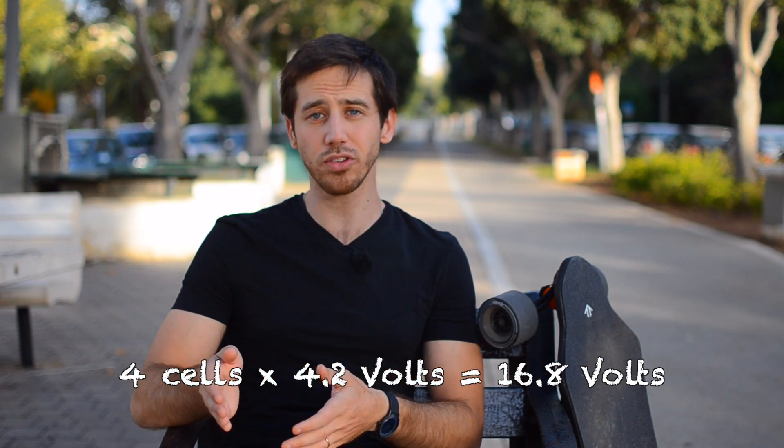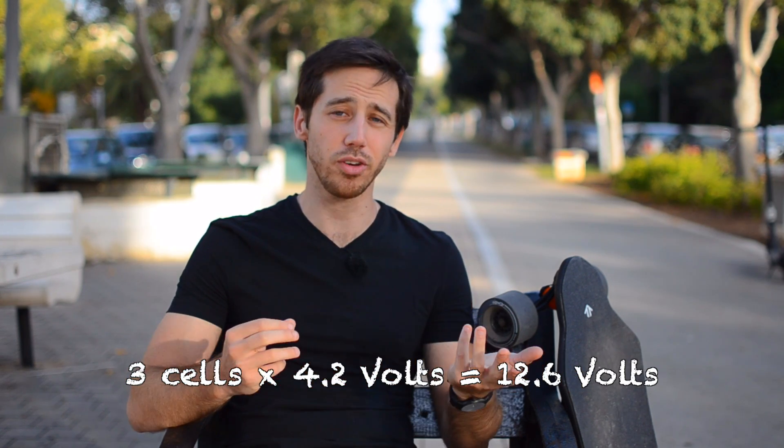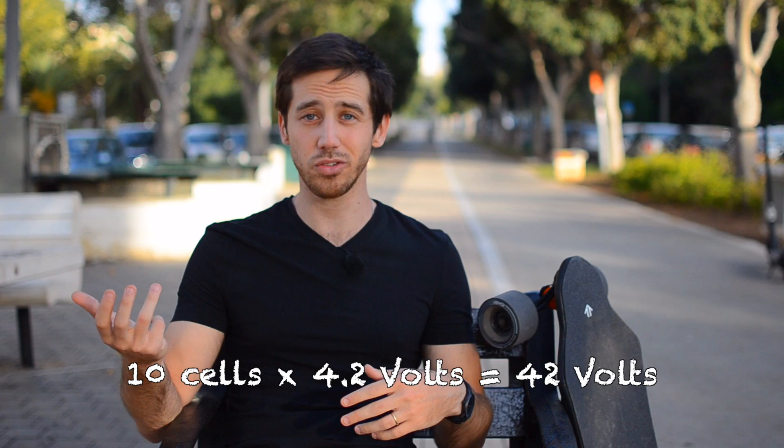The last question I saw a lot was how to find the right charger. I already had a charger for that battery so I didn't discuss it in the video, but it's pretty simple: you always want to match your charger to the voltage of the battery. In this case, the battery is a 4S pack, meaning it charges to a maximum of 16.8 volts. You figure that out by taking the number of cells in series — in this case four — and multiplying by 4.2 volts, which is the fully charged voltage of a lithium cell. So four cells times 4.2 volts gives you 16.8 volts. I found a 16.8 volt charger; I stock these on vruzen.com, but you can also search Amazon. If you're building a 3S battery, you'll want a 12.6 volt charger. A 10S battery needs a 42 volt charger. Just multiply 4.2 by the number of cells in series and you've got the voltage of charger you need.